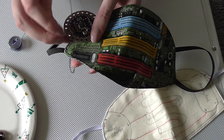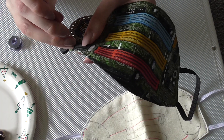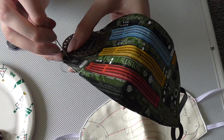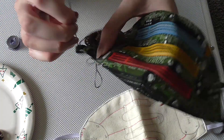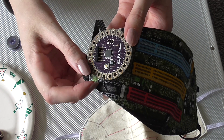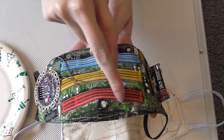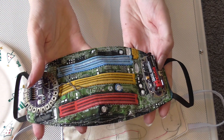I like to start by connecting the LilyPad to the battery pack first. Start by looping the thread around the pin a few times. Make sure to start and finish your thread in a way so that it doesn't touch more than one pin at a time, otherwise this will cause problems with the circuit. There are two ways to sew the conductive thread: one is with a back stitch, which creates a distinct linear thread and is probably the most reliable way since there will be more thread for electricity to flow through. If you don't want to back stitch everything, I'd recommend doing back stitch for only the battery pack connecting wires and then a running stitch for everything else. The main issue I've had with the LilyPad is not having a strong enough connection between the LilyPad and the battery pack, so back stitch solves that quite well. Once you get to the battery pack, loop your thread around the matching symbol a few times and cut off the thread.